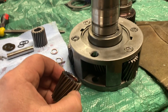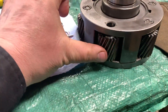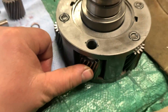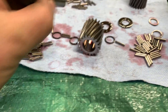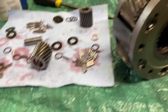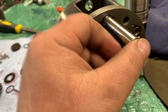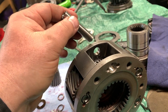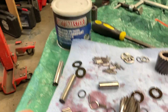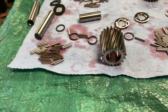I'm gonna cut the third pin to the same size so as I fill the rollers I can put it inside as a spacer and slide it in, then press it in. This is the pin I made - it's gonna fit nicely so I can feed the rollers in and have it hold them in place. I also rounded it off a little bit because when you punch it you deform it - that way I can slide it in. This end is a little bit smaller so it gets stuck, which is good because I'm gonna press it through and tack weld it into place.